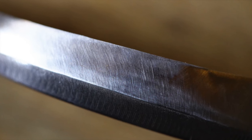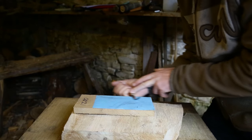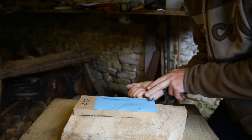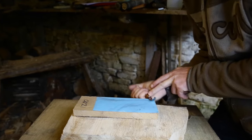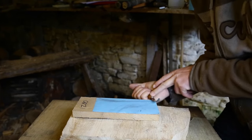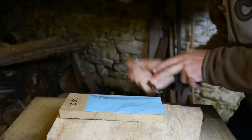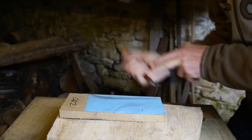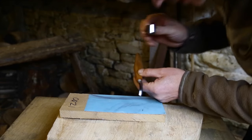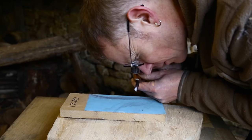If they do, I'm ready to move on to the next, finer abrasive. Now I'm going on to 1200 grit, just doing the same thing again — probably about 15 or 20 times. I just want to remove all the very coarse scratches from the 800 paper in a nice consistent action going all the way to the edge. When I look at it now I can see it's much more polished all the way to the edge with a finer scratch pattern.